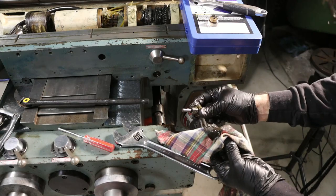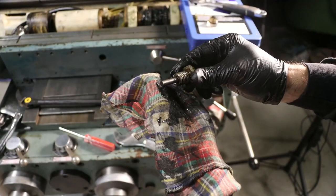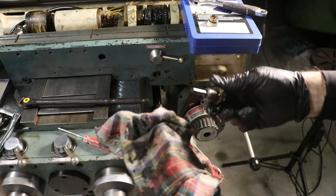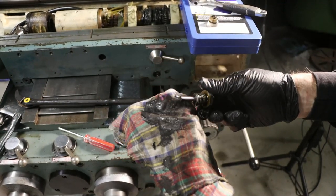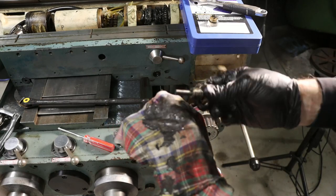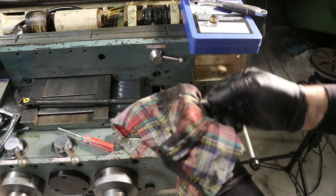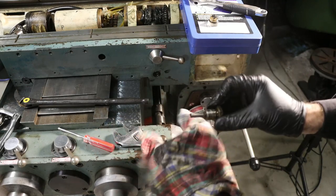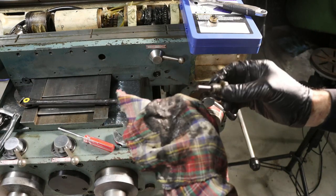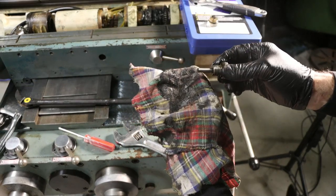It's a big magnet. Here's a little closer look. It's just super fine sludge. I've seen people freak out over that, but really, that's pretty much normal wear on an old gearbox. That won't hurt a thing usually. They all are going to generate some sludge. There's no filter or anything on this gearbox, obviously, so not surprising.